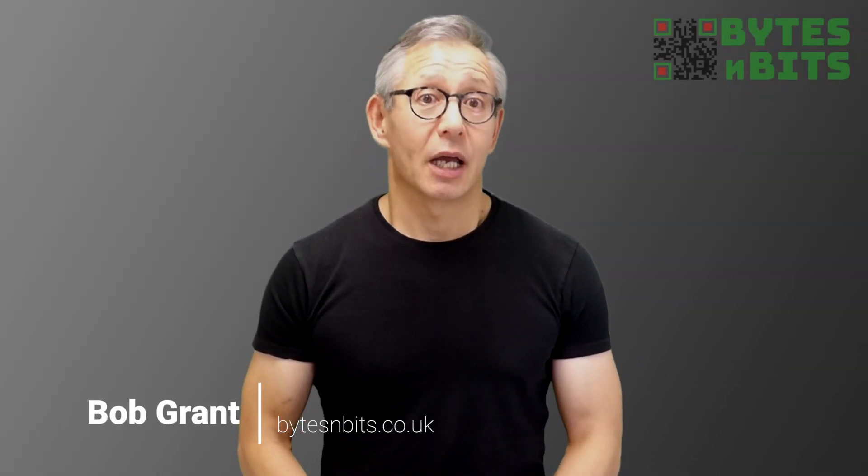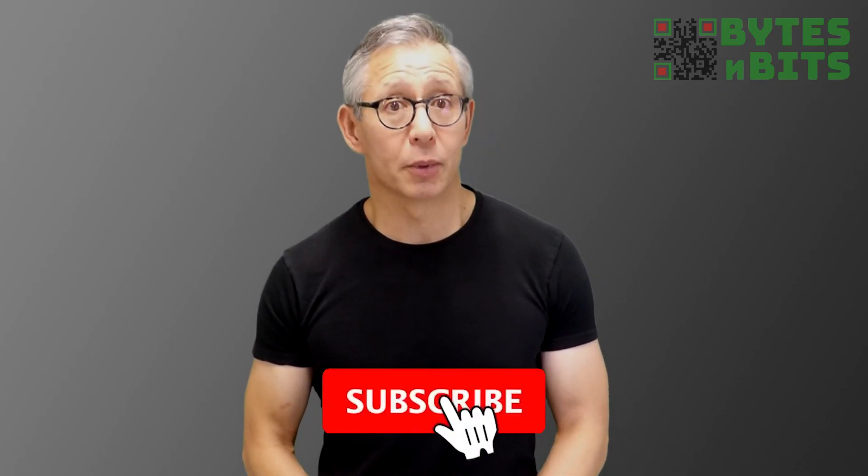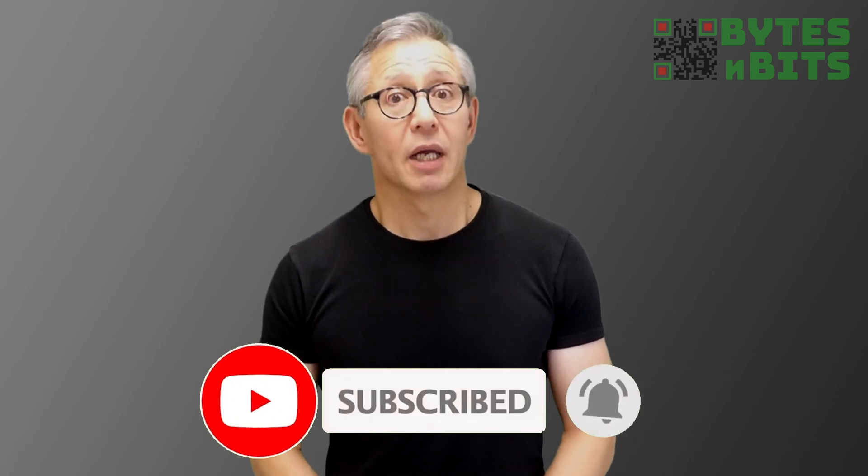The Raspberry Pi Foundation has finally released an upgrade to their ultra-small form factor Raspberry Pi Zero. The Pi Zero 2 has exactly the same form factor as the original Zero, so you should be able to use it as a direct swap in any of your projects. The main difference is that the original single-core processor has been replaced by a quad-core 64-bit ARM Cortex-A53 running at 1 GHz, and we still have the original 512 MB of DDR RAM — but even so, this pushes the new Pi Zero fairly close to the performance of the Raspberry Pi 3B+.